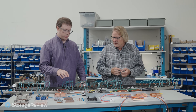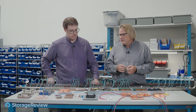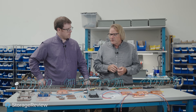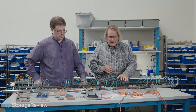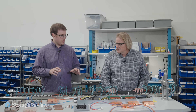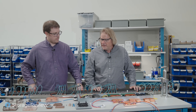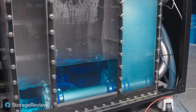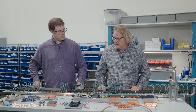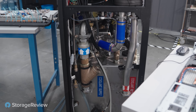Is there a strong difference between using a metal versus a plastic turbulator? The heat transfer is a lot better with a copper turbulator because it transfers heat from the water on both the outside and inside. As for corrosion, they've been running soldered-in turbulators on cold plates at Sandia for about nine months with no corrosion issues whatsoever. On coolant, Chilldyne prefers water over PG-25 because water has better heat transfer characteristics and is easier to dispose of — you can pour it down the drain instead of calling someone to haul it away. They use a tiny bit of oxidizing and non-oxidizing biocides to kill algae or bacteria, plus about 40 parts per million of molybdate to prevent corrosion on stainless steel and copper surfaces.